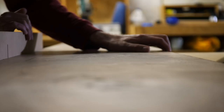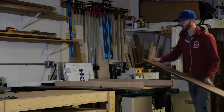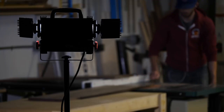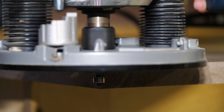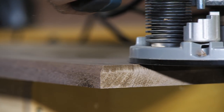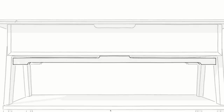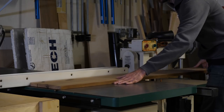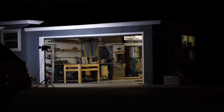The next night after work, I started cutting the top and the lower shelf piece. The lower shelf piece I left oversized for the time being because I knew I'd have to cut it to size based on the dimensions the base dictates as things come together. But the top could be cut to finished dimensions right here. Then I used a chamfer bit to route a little 45-degree detail on the underside of the top. I normally make my bevels a lot sharper and more drastic, but I just wanted to be a little more subtle with this piece. Flash forward another 24 hours, and the next evening I started cutting out these little detail cross-stretcher shelf support things — I'm not really sure what they should be called, but they do give a little support towards the center of the case to help prevent sagging. So I'll call them case bras.